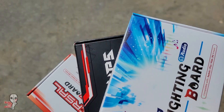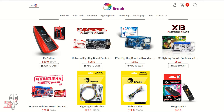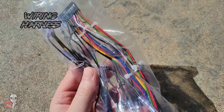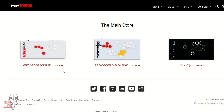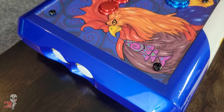Following that you'll need a PCB or printed circuit board to act as the brains of the fight stick, which can also balloon in price depending on which systems will require compatibility. Then you'll need a wiring harness to connect everything, a neutrik or comparable connection port, and a USB hookup to link it all to a console or PC. All-button builds like a branded hitbox controller require all the same parts minus the joystick, but they'll need an additional four face buttons to take its place.